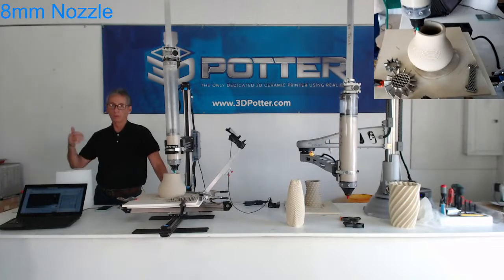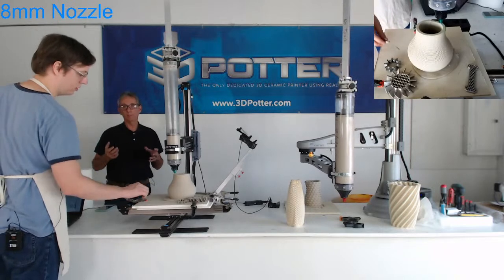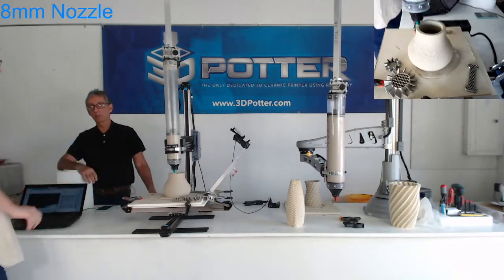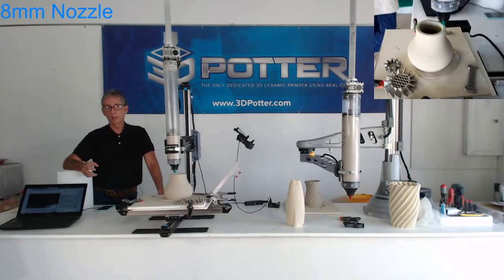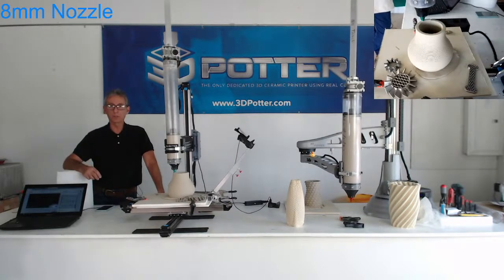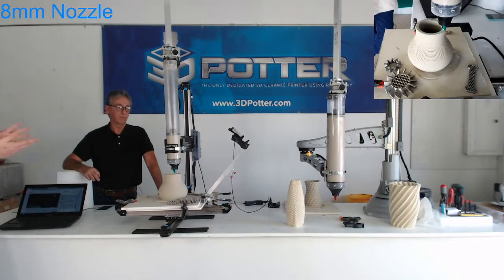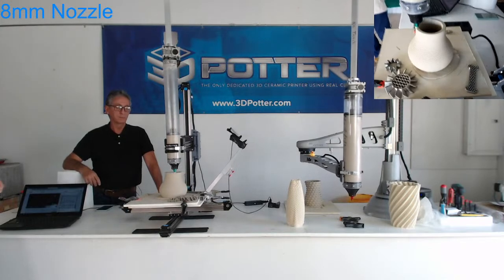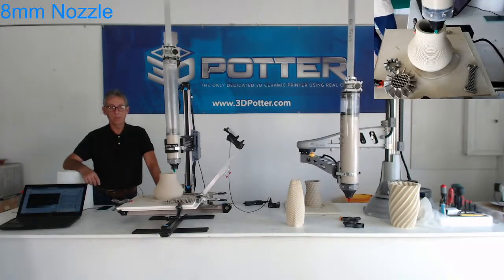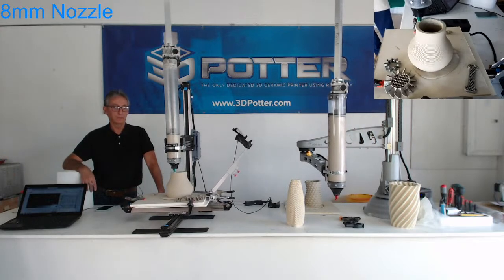But here's the problem. In our pug mill, we have a Peter Pugger, and you'll get some hard debris around the lid, and that hard clay goes down into the clay body, and for some reason, it doesn't reconstitute. It'll actually come out hard. That little chip I showed you, for our stoneware, doesn't reconstitute on its own. It'll stay dry as a little chip, even running through our pug mill for 30 minutes.